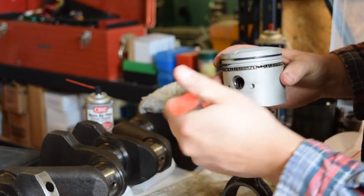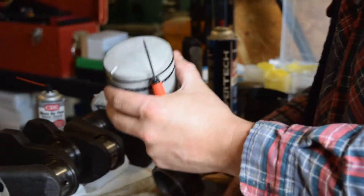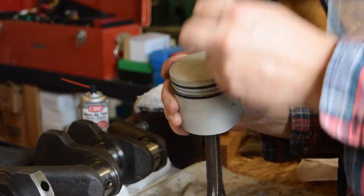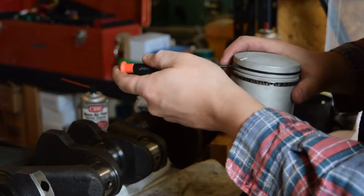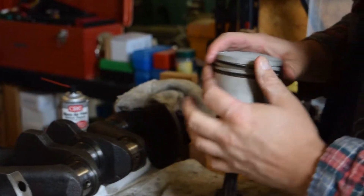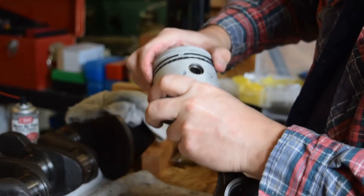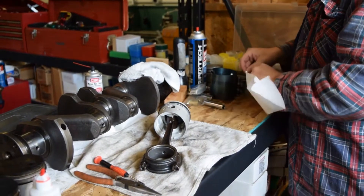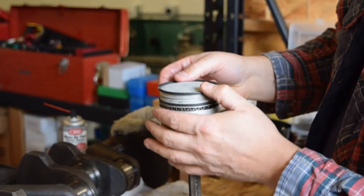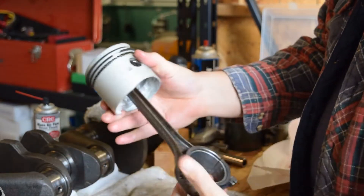My little one just went out and was knocking things over. The name of our channel is Gun Tractor — you're probably wondering why we only post tractor videos; we're going to do some gun videos, we just haven't got to it yet. Using a little screwdriver to work the ring — some might say you'll damage the piston, but it's aluminum and it's tougher than you think. So that ring's on. Then we put our last ring on — it's also directional, says 'top.' The gap is here so we'll turn it around. That top ring goes on like butter.